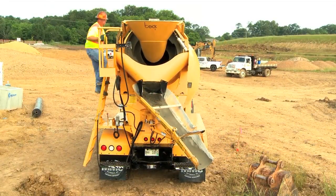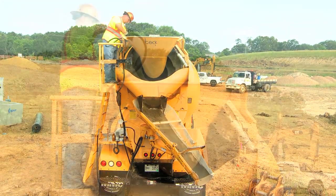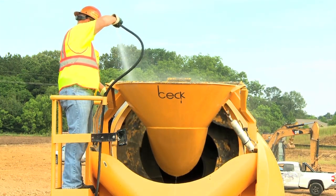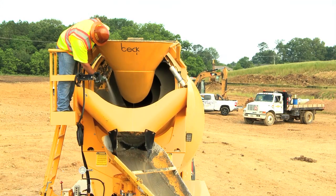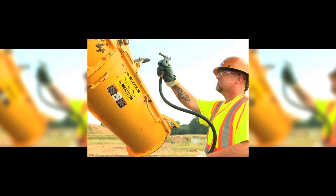Additionally, for every pound of concrete that you remove, you can carry one more pound of fresh concrete in the next day's load. As outlined in other lessons, this procedure generally starts before a driver leaves the job sites throughout the day. Rinsing off hoppers, drum blades, and chutes with about 5 to 15 gallons of water from the truck's water tank assures buildup of fresh concrete is minimized as much as possible from load to load.